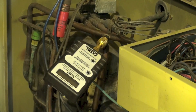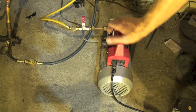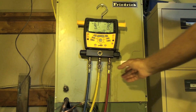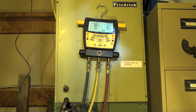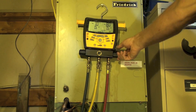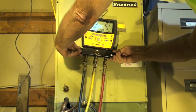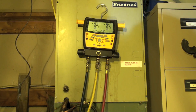Let's go back to the pump. I'm going to start the pump, open the valve, make sure everything's tight. I'm checking that all these hoses are tight. Don't get looney-tune on tightening these things, but tighten them down. The valves are open — I like them back-seated. It's better back-seated from here. Again, we're dealing with very small pressures.